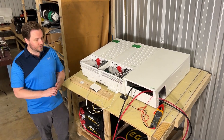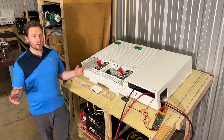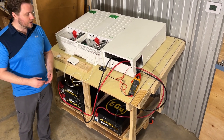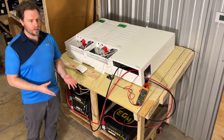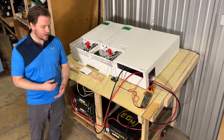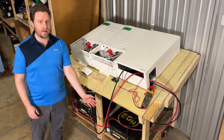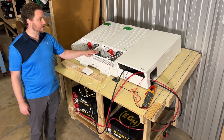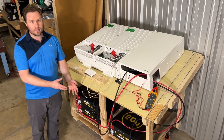For the people who feel like they must go outside of industry standards, the new firmware is going to be a solution for you. Honestly, we think that you're going to be disappointed in the long run because you've got a battery that can only output 5,000 watts, and up here you've got 13,000 watts of inverting power. So you're going to trip anyway when you hit that limit.